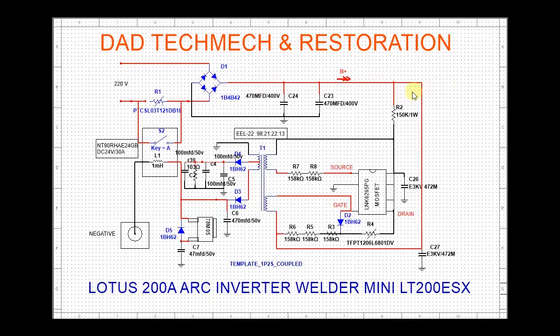In this diagram, this is the path the current takes. I'll show the actual measurements in the next video. From here, you can see where the fault is. Current flows toward the chopper. The 326V goes here, then to the chopper, down to the gate of the MOSFET — the 626. Then to its source, it will switch and activate the chopper.